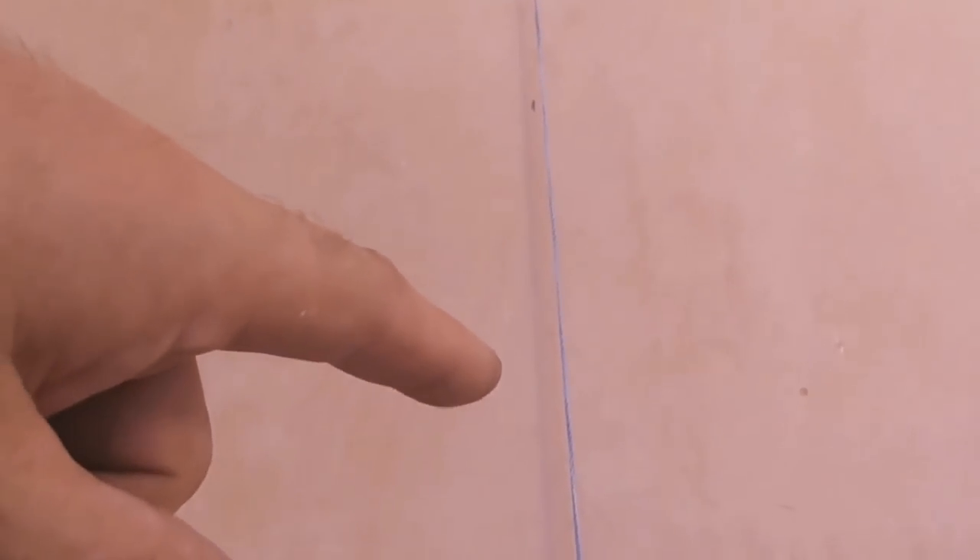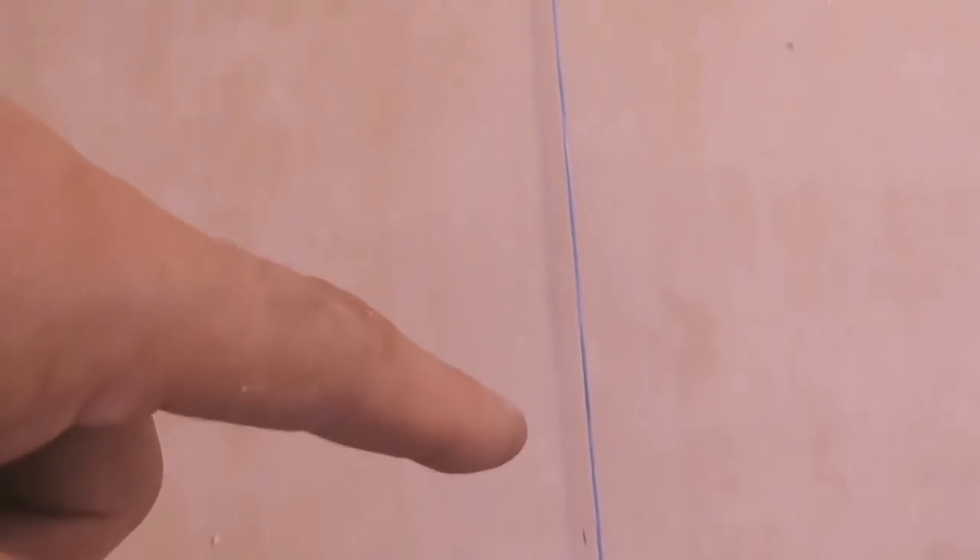I won't have any problems with the corner — it's going to overlap properly. It is important that you get these lines straight. If I was just to follow those pencil marks off my measurements from out the corner and not straighten them up, then by the time I get to the other end there's an arch there, and the bottom of this arch could be an inch out. I could end up with a silly wedge running up the side.